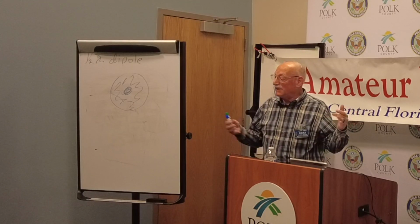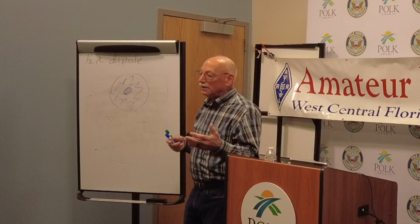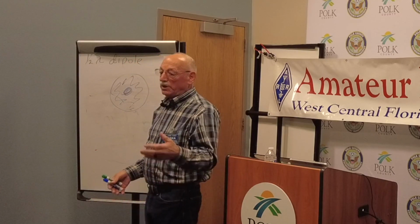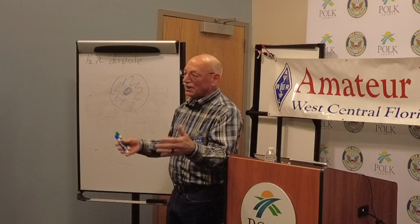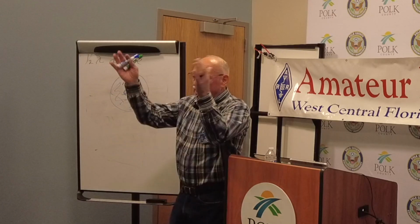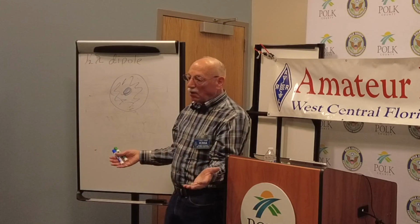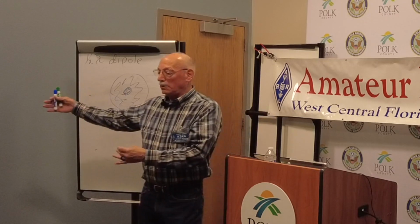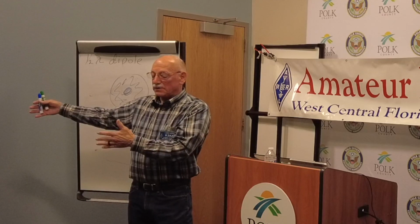Why is this of interest? How do we phase antennas? We want to run phased antennas. What do we usually use to, maybe I shouldn't say usually, but what can you use to run antennas out of phase? We can use coax, lengths of coax. You want to run them quarter wave out of phase, you feed the second one with a quarter wavelength at that frequency, put it out of phase.